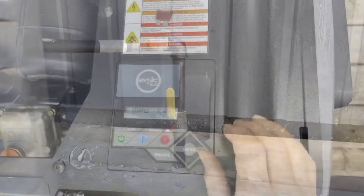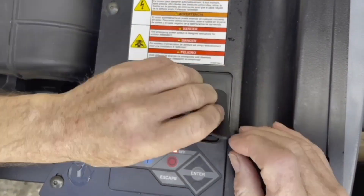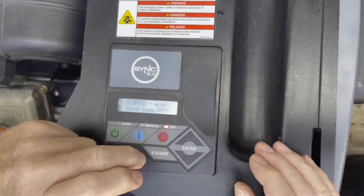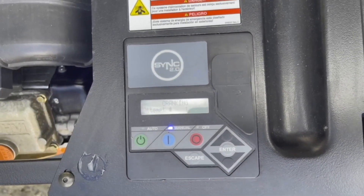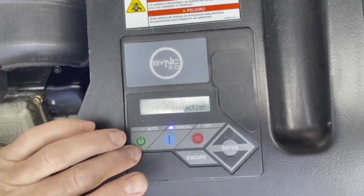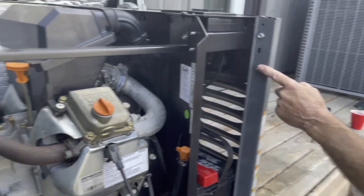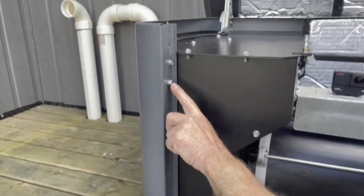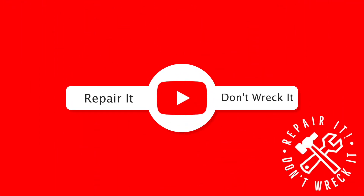The generator is in running mode, but let's review the restart procedure. Turn on the fuel supply and install the 7.5 amp fuse in the controller. Set the controller to the off position. Since we created an alarm, press escape then enter. Press manual to start the unit and check that everything is connected properly. After that, put it in the auto position and you're ready. Now it's time to put the front door on and close the lid. The slots on the bottom of the chassis take the pins on the front door at the bottom; the top pins on the chassis go into the elongated slots at the top of the door. Make sure you check out my channel for other maintenance videos including Generac generators. If you like this video, give me a thumbs up, subscribe, and as always — repair it, don't wreck it.